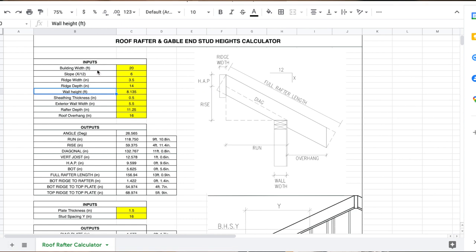This wall was a pain to plan for, especially since I have no experience building gable walls like these. For that reason I made my own roof spreadsheet, which you can see here with a sketch on the side. This will obviously be helpful once I get to building the roof, but it also plays a role in planning for the stud heights I'll need for the balloon-framed wall.